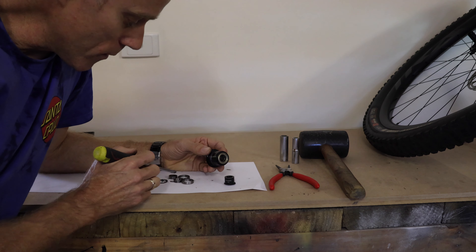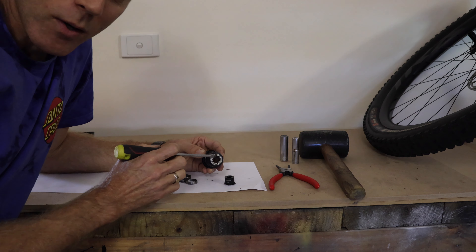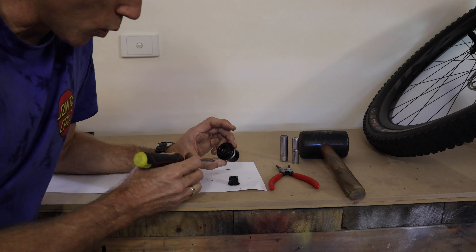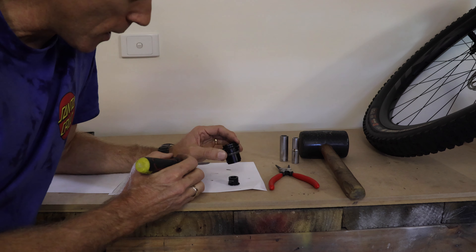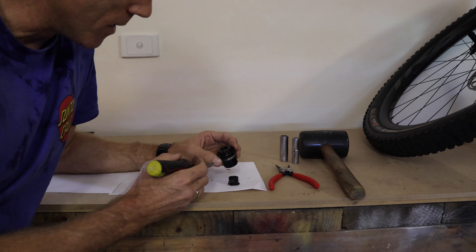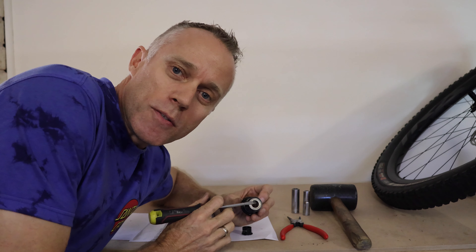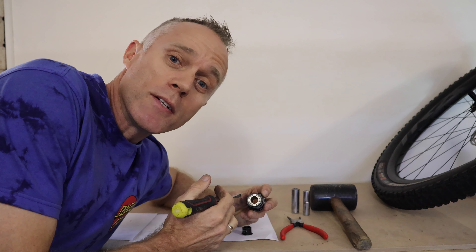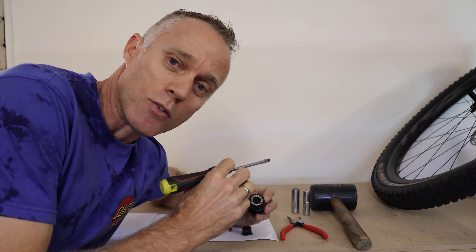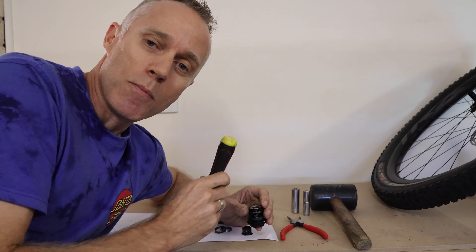There's all the rubbish that fell out of the bearing and driver - all the ball bearings fell apart. It meant I needed to get the outer cases out manually rather than tapping them out. Drive them out with the press easier because they won't fall apart, whereas once they fall apart it's extremely difficult to get the outer cases out. I showed you my method using the press to put the bearings in. But for those of you that don't have a press, you can tap them in - just use the socket to work on the centre of that bearing. If you haven't got a press, just tap them in and you should be able to get them in.